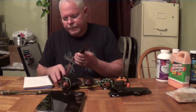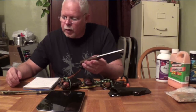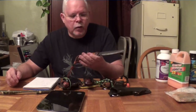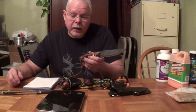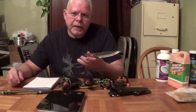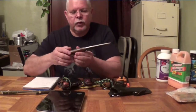I'll go ahead and read off the specs. It's full tang, 1095 high carbon steel with a Rockwell hardness of about 57. It's got G10 scales in orange and black. You can also get them in two other colors — one is a gunmetal gray and black. I can't remember the other one, but I'll give you links to the website so you can look them up.